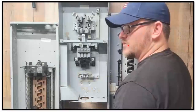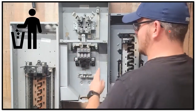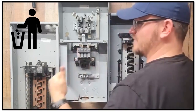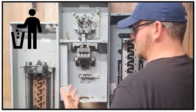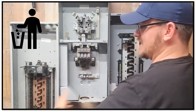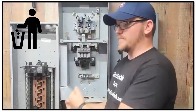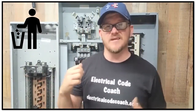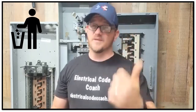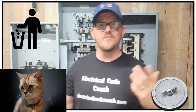Or you'll be out doing a panel change and somehow it'll end up in the trash bucket. Anyway, long story short, you can still use these other holes, but they must be used for the feeders. Anything past the first point is either going to be a feeder or a branch circuit. So once I get my service conductors in, I can use this hole, or either one of these back holes to either pop in the house and feed the main panel, or pop out and feed a branch circuit, my HVAC, or my garage. It's happened to me before where I set the panel, knocked a hole out, and realized I didn't go through the channel and had to pull the whole thing apart and start all over. Especially when you're doing a panel change, it may not be something you think about. And if you've never noticed that before and you're wanting to do underground, that's just a little tip and trick. It's a very easy place to fail your inspection, potentially mess up your panel where you have to get some Hoffman plugs — you look like an idiot in front of the inspector and may cost your company a day.